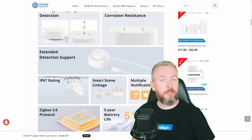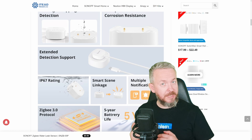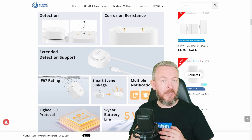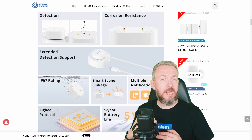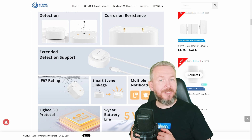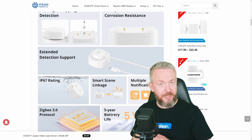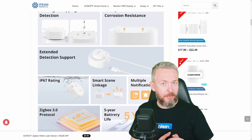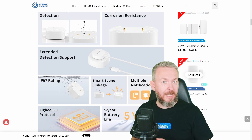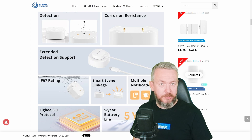Comparing it with the IKEA one: the IKEA one is awesome because it has sensors on both back and front, so you can keep it under the sink and also detect water leaks on the floor. But the problem with the IKEA one is that it is not waterproof — this one is. However, don't keep it permanently submerged in a pool or aquarium, because it is rated only at IP67, and over time water may seep into the device and it could stop working.